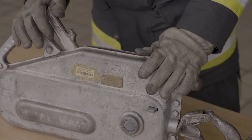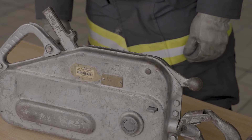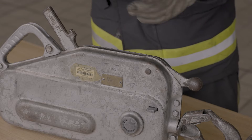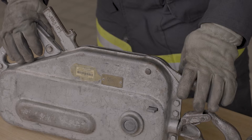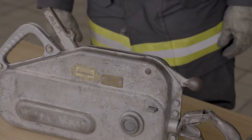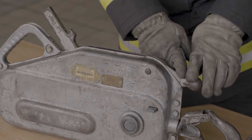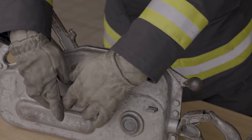Each machine is fitted with the rope release lever for releasing the jaw mechanisms internally to the Turfer winch. I need to reiterate — we can only operate this lever when the machine is not under load. If the machine is under load, we do not touch this lever at all. There are two positions for the rope release lever: released and engaged. What we're thinking about is the jaws, not the springs, because it's counter-intuitive when you're actually playing with it — so it's the jaws that we're talking about.